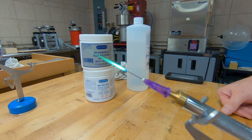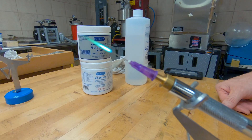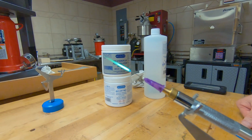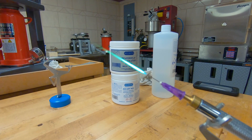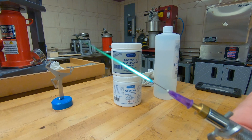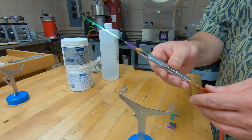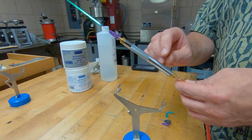You can see that the flame is slowly decreasing — right there is a 0.6 tip on a power rating of two. I'm going to go ahead and turn it up to seven, let that adjust and regulate. And there is a power rating of seven with the 0.6 millimeter tip — that's a really good tip for doing smaller work, fine chain repair, things such as that. Now let's go ahead and switch out tips, but let's talk about the torch itself. This torch constantly has hydrogen running through it. You saw that I was testing the flow on my hand to make sure we had gas. This torch handle does not shut off — it doesn't have a valve you can turn.